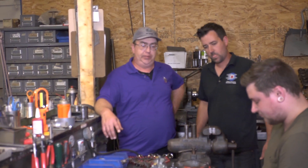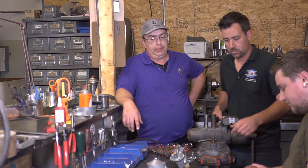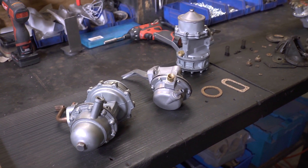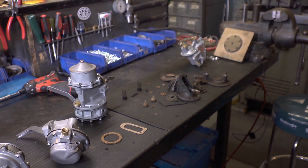One of the most important things other than water pumps is going to be your fuel pump. I can't imagine how many times even working over at the Classic Drive TV shops we've had issues with fuel pumps. We've got a lot of old cars over there. The diaphragms get worn out. The fuel nowadays is terrible — it really ruins everything. So if you have a classic and you need a fuel pump but you can't get it, or you just want a really great rebuild on your fuel pump, one of the other things they do here at Arthur Gould is that. Parker, talk a little bit about fuel pumps. Folks send us in their mechanical fuel pumps, we take them apart and inspect them, and they come in in all different degrees of wear and tear — typical 50 years under the hood. The corrosion — these are mostly cast aluminum, so if the pump was subjected to moisture, you're going to have corrosion.